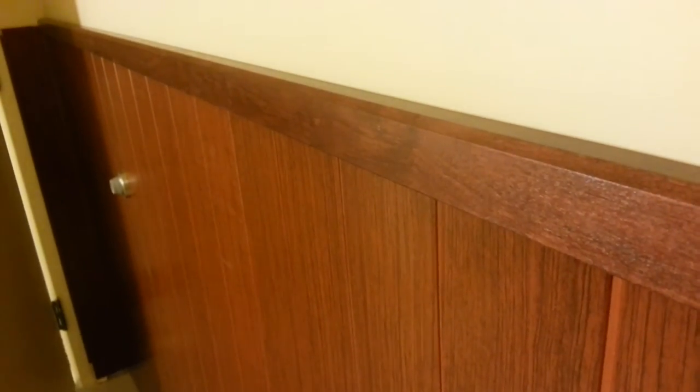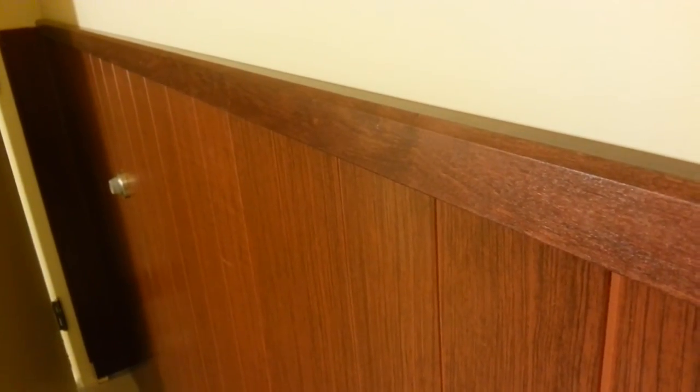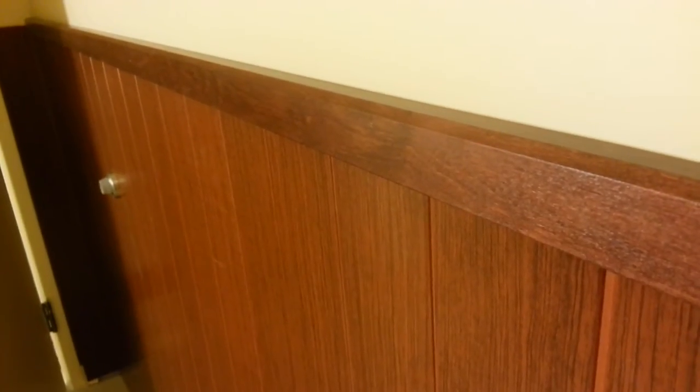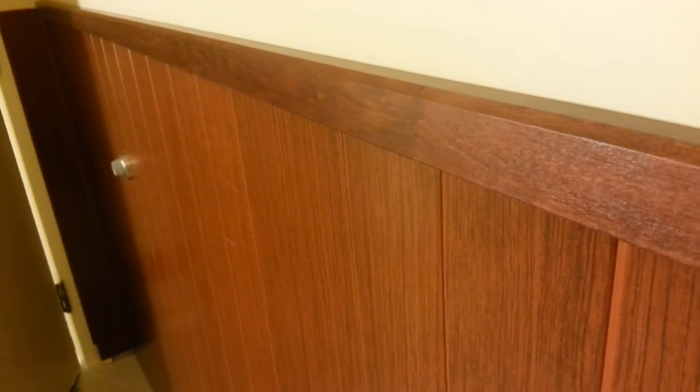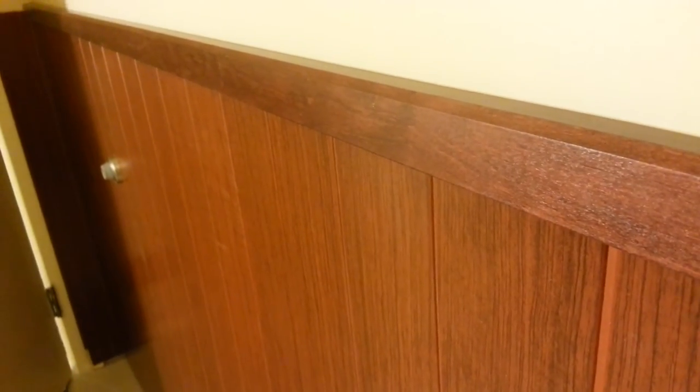Use a laser or snap lines off of a level surface. Never pull your lines off the floor, okay? That's one thing I see that baffles me. The floor is always screwed. It's almost never straight. Sometimes it's within an eighth or so, but when you get in a room, most likely, if it has a hard lid, when they put that in, they leveled it.